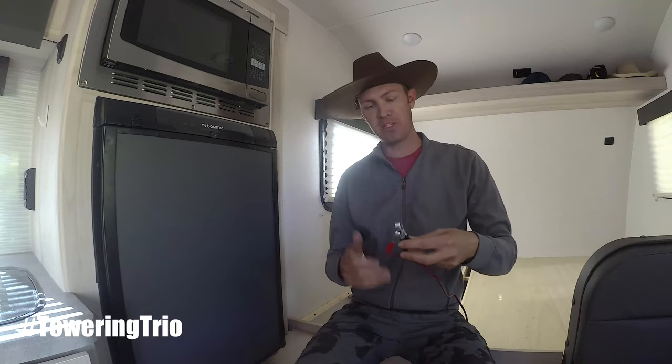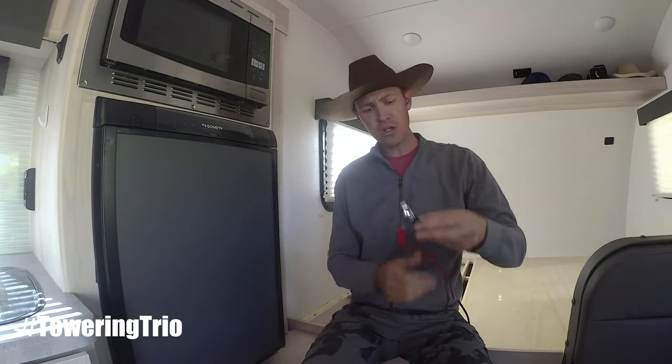If I disconnect these two wires, that is opening the connection — basically turning the switch off — because you want it on for it to stay connected. It's blowing hot air down here; it's getting warm. If I turn this off, it'll read as a fault code that the switch is not closed, so it'll shut down and stop blowing hot air. Then it'll exhaust all the air from the chamber out the side of the coach, shut down, and go into lockout mode. You'll have to turn off your thermostat, flip it back on, and then it'll try again. So you want to leave this connected — that's bypassing the switch.